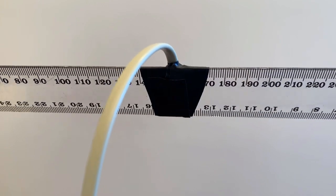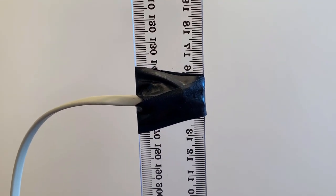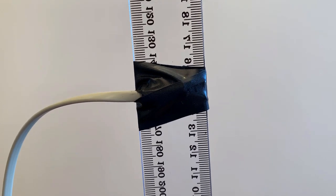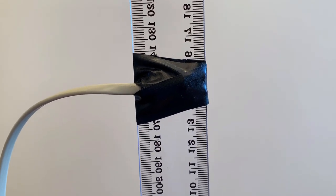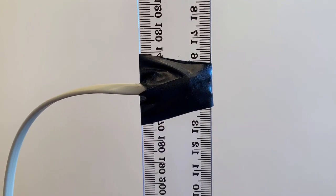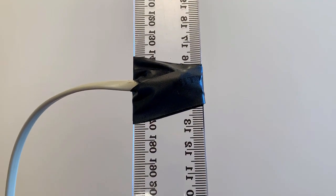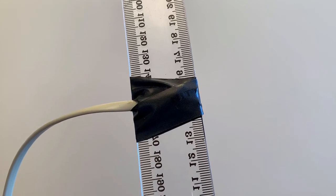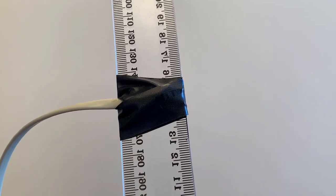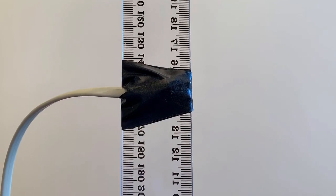Now I focus on the left side of the sensor. I point the left side of the sensor vertically and search around until SarkTrack stops beeping. This is point number seven complete. Next, I point the left side north at my local magnetic inclination and search around again until SarkTrack stops beeping. This is point number eight complete.